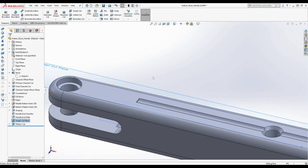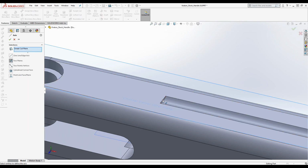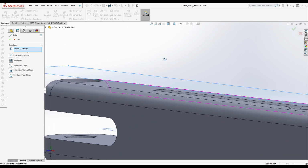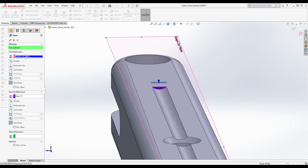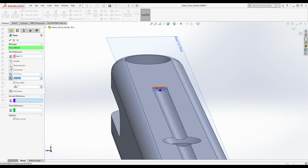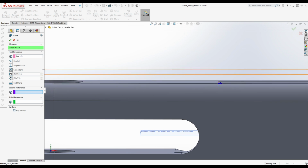I'm noticing that you work on a lot of layers. It's kind of like digital art, people work in a lot of layers. Okay, here's what we're going to do. We're going to do this where two planes intersect, but we need to create that second plane. It's going to be coincident with this. Think of this plane as if it were enlarged. The plane is technically infinite. So we're going to create an axis where this plane and this plane intersect.